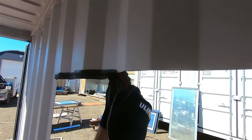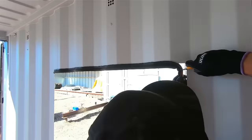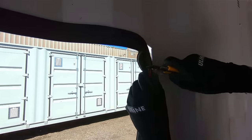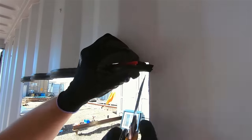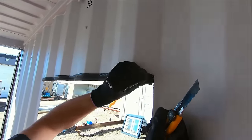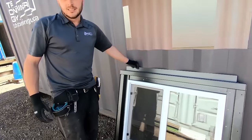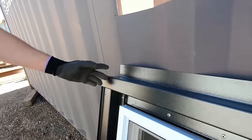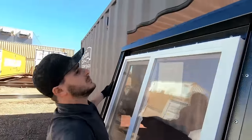You can also do it along the side — there's some that doesn't have the bulb on it, or some that has the bulb on the side rather than the top. Take your knife, get the rough cut in between. There are some metal supports in there that are kind of tricky to find — clean that edge up. Here's our window frame kit. This top flange actually gets up and holds the window in place once you lift it up there. What used to be a two- to three-man job, you can typically do by yourself.